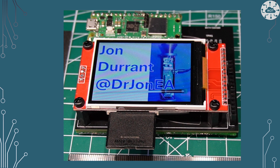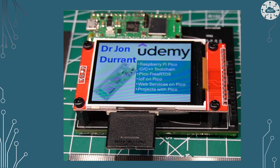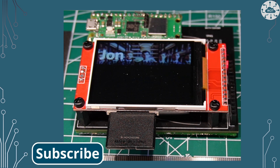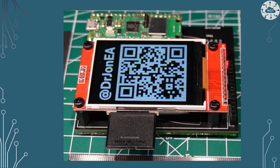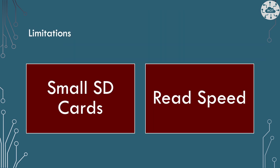I actually use PowerPoint to generate a set of images — I set the slide size to 320 by 240 and export as PNGs in exactly that size. We've got all these nice little images being pulled from the SD card and displayed on the screen. It's relatively quick, though you can see it drawing lines — the read from the SD card is a little bit slow, which I'll come back to in a second. But it really works quite well and we can display PNGs straight from the SD card onto the screen.